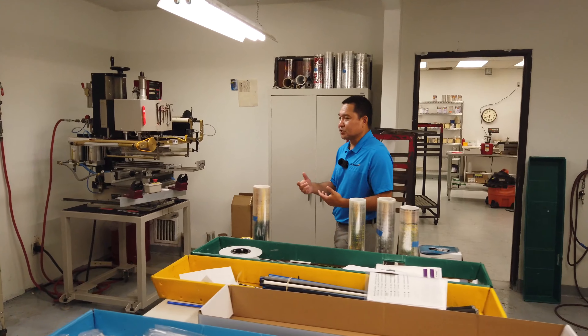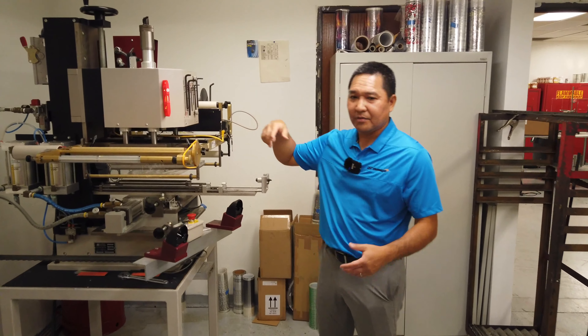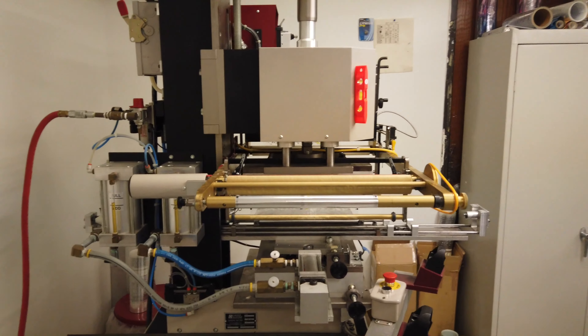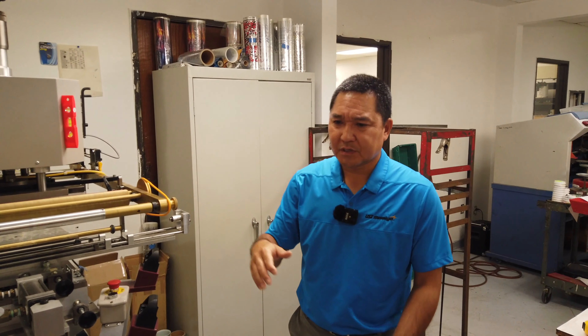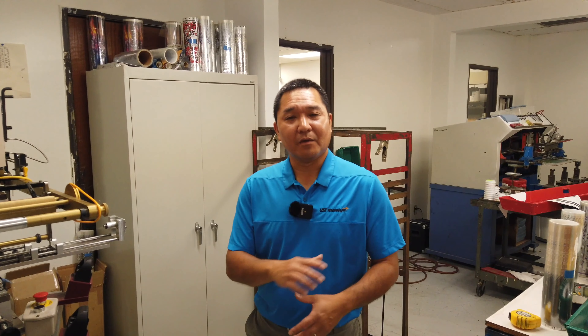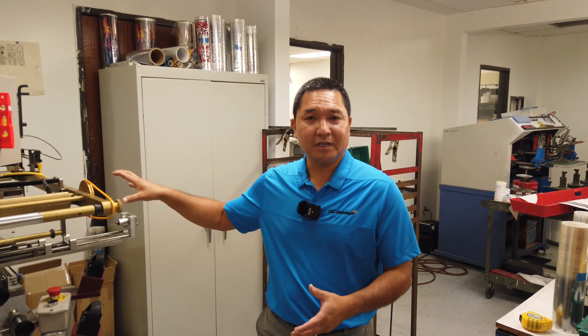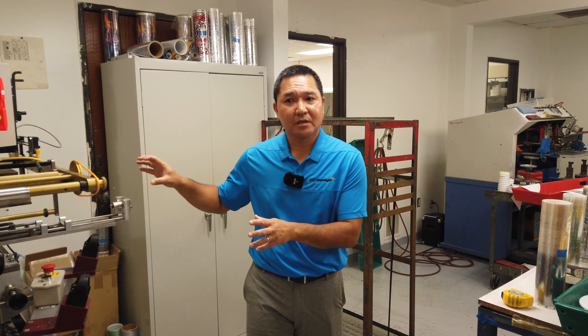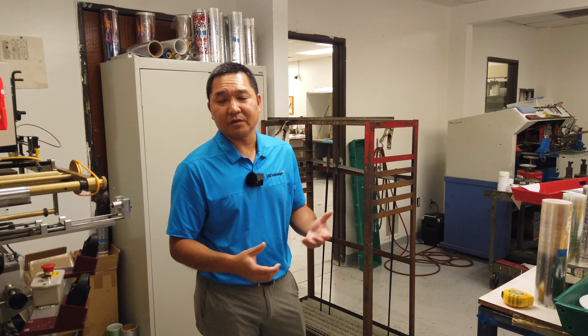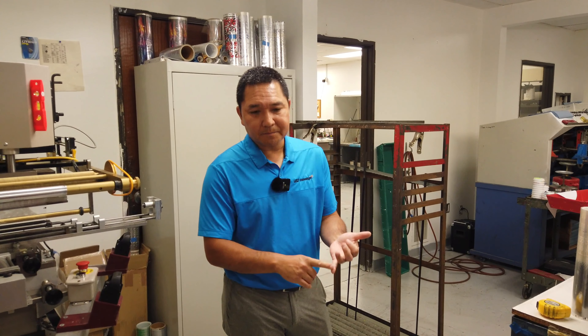A simpler process is what we call a heat transfer or decal machine. We have this decal machine here — it's essentially a big sticker. You put the golf shaft on, apply the heat pad, and the decal rolls onto the golf shaft. So it gives you the graphics in one step and then we can finish it — a lot faster, less labor intensive, and also a little bit better detail with decals. Both methods are easy to do; it's just a matter of which one we choose from a production standpoint. Those are really the couple of methods to get the look and graphics onto the shaft.